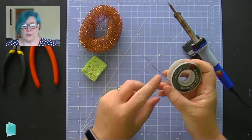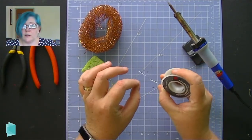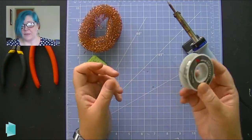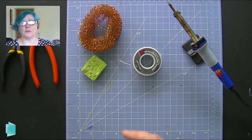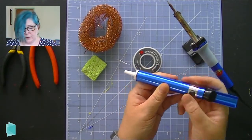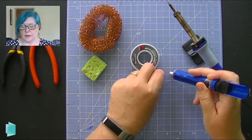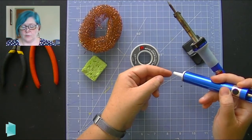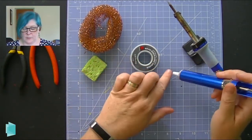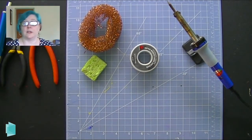As I mentioned before, your solder width or gauge is based on the type of project you're doing — the more fine and small the project, the thinner and higher gauge the wire. I also keep a solder sucker on hand. This works by pushing the button down, then you warm the solder and when you press the button again, it creates a vacuum and sucks the solder up into the solder sucker, removing any mistake you might have made. You can also use a solder wick, but I prefer the solder sucker — kids really enjoy it.